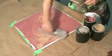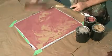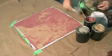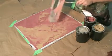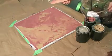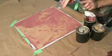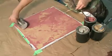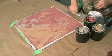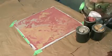While this partial layer is wet, trowel a second color of aggregate onto the surface into some blank areas and some coated areas, always being careful not to overdo it. Finally, trowel a third color onto the surface. Try to pick places that will give a good broken color effect.